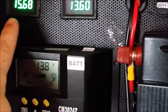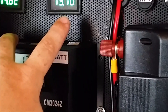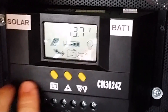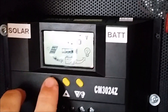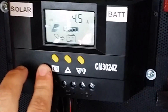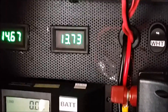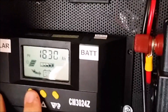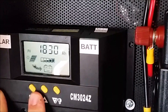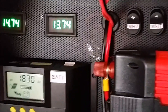Right now you can see the panel voltage is about 15 volts and the batteries are at 13.6 to 13.7 volts as displayed here. I can see how much amperage is coming in from the panels — right now about 14 amps, and it's not even noon yet, so that's pretty good. Scrolling through the menu, I can see I've collected 1,830 amp hours since I installed this controller.